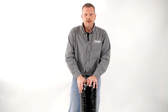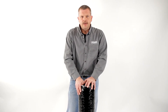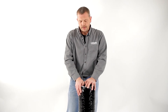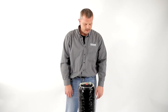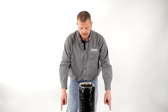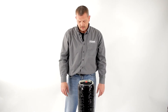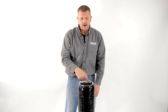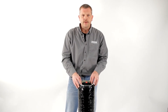When you install this, you're going to install it with shutoff valves and a bypass. This allows you to bypass the filter if you need continuous flow while you're changing or servicing the filter. Typically, you'd plumb into a T, then out of the T into a shutoff valve for the inlet, a shutoff valve for the outlet, and then two T's that come together with a loop and another valve in the middle. When you take this filter offline, shut off your two T valves, open up your bypass valve to allow water to flow through, then release the pressure and change your filter. Bring it back online in reverse order.